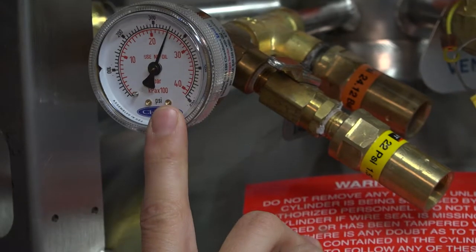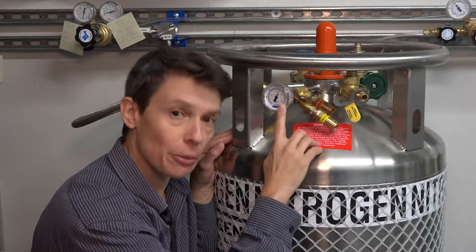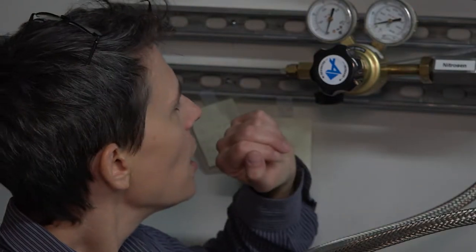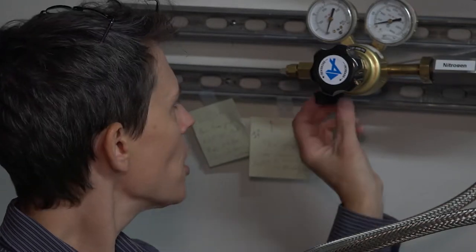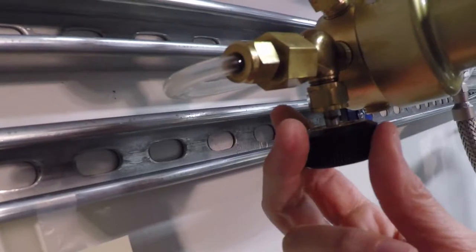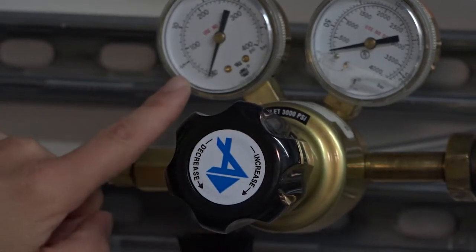Note that the pressure inside the tank is 350 PSI. That is the maximum pressure that these tanks can hold. They will blow out of these purge valves when the pressure is too high. This pressure gauge should equal the pressure gauge on the nitrogen tank. This valve opens the nitrogen to the system counterclockwise — turning the valve open all the way and then quarter turn it back. There is no purge valve in this line. The pressure out should not exceed 10 PSI. In fact, you don't want the needle far off the zero pin at all.